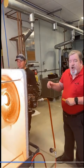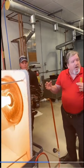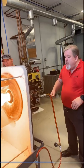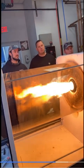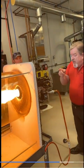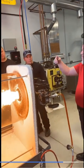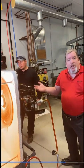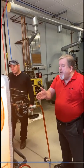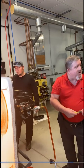Notice how it's hitting that back wall. I can't emphasize enough how this demonstration helps technicians understand when you're doing the head setting — why you're doing it and what effect it has. You would never just move that head forward just for the heck of an adjustment. This burner currently has a .85-80 nozzle in it. The only time I would consider moving that head forward is if I looked in my spec guide because I needed to go from a .85 to a one gallon an hour to increase the BTUs. I'd probably have to change my head setting, add more tertiary air, adjust my air band, and then take a combustion test to confirm everything is done correctly.